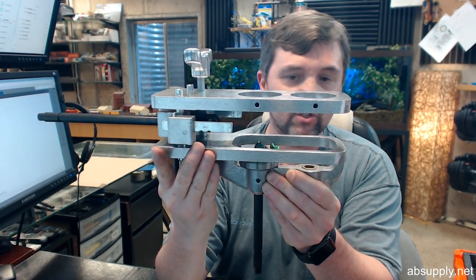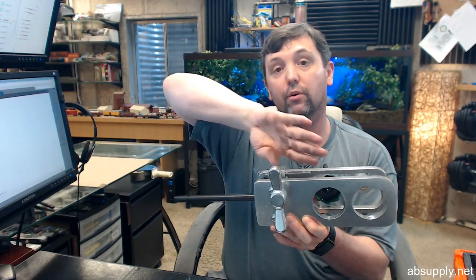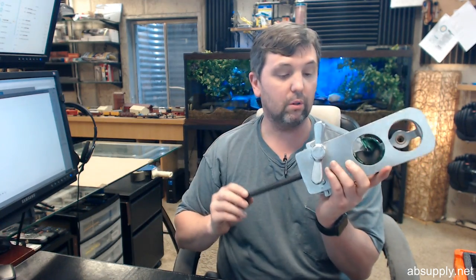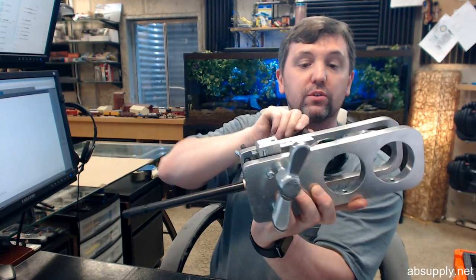And there's your installation. So you'll mark your door after your back sets are correct. You're going to make sure that your bevel on your feeler gauges are correct. Install it however you're going to install it. Tighten it down to the door. And then at that point, you're ready to roll. I would always do the crossbore first.